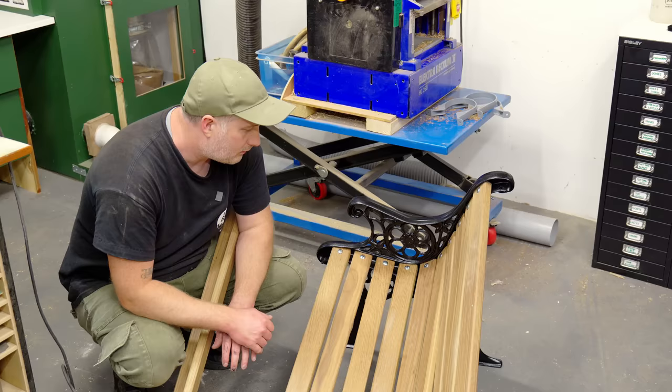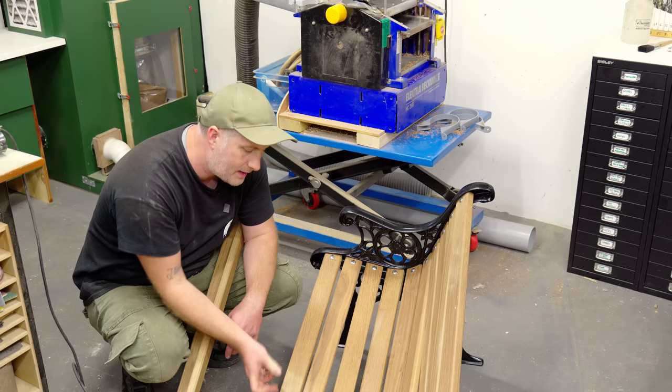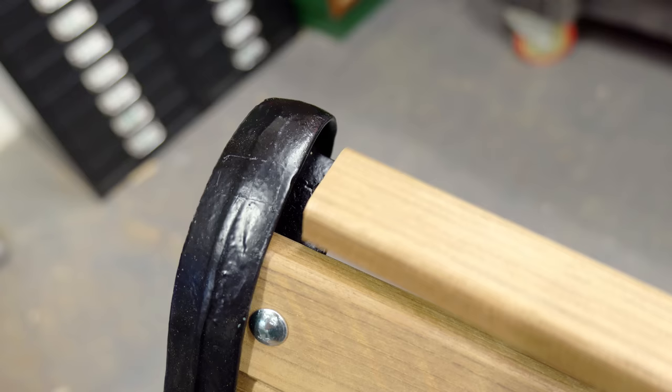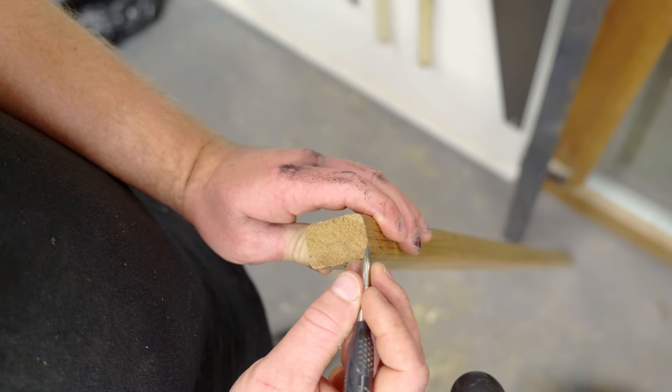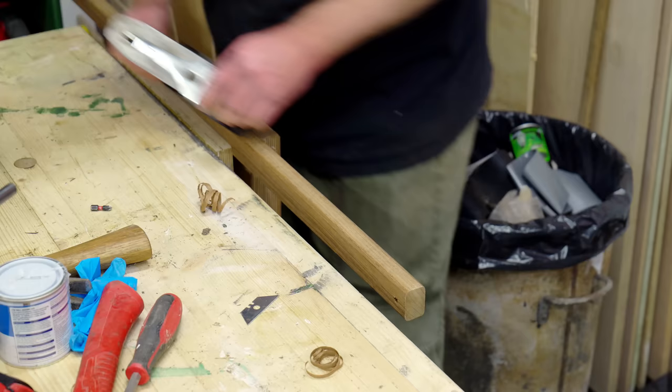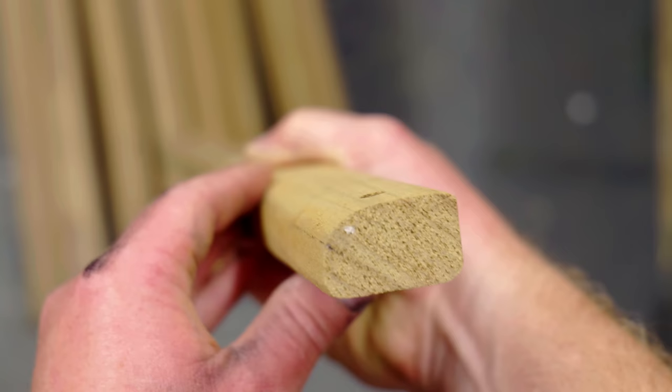And now on to the third challenge. I've got all of the slats fitted except for two, because I cut all of these slats to 55mm wide by 25mm thick, but for the two remaining slats that fit at the very front and at the very top, 55mm simply wouldn't fit. So I've ripped these down to 35mm and offering them up I can see that still they won't fit inside here. I'm going to need to cut a bevel just off one corner and then they should slot in.